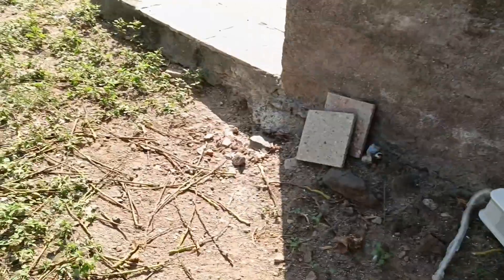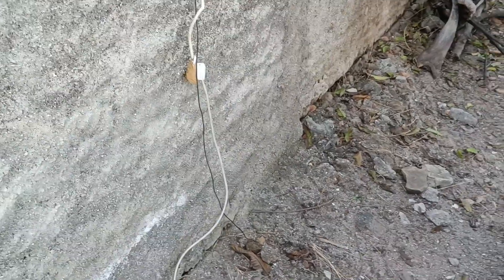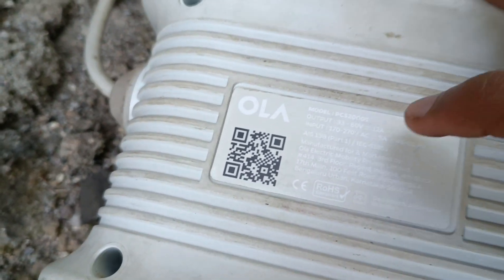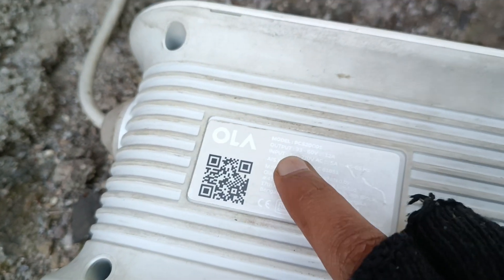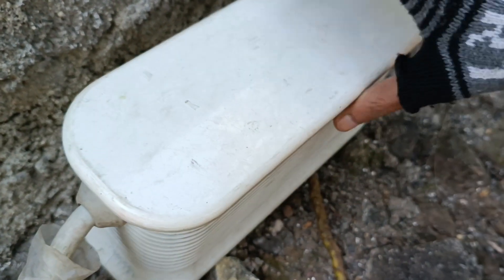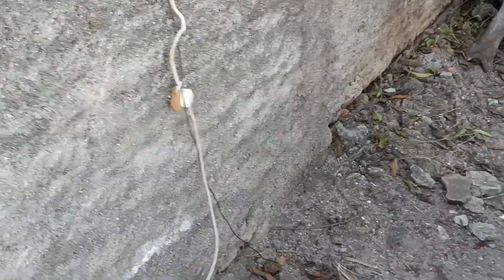I have come to my house where the voltage is about 160V. The charger requires a minimum input voltage of 170 volts — you can see here on the charger label: input voltage 170 to 270 volts. So it will work up to 270V, but the minimum is 170V, and here we are only getting around 165V.